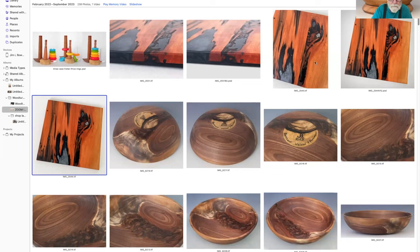Now, I'll admit they were both using Alumilite. But it reacts extremely badly to any moisture at all. When you put it in a pressure pot, it came out as if it had foamed. It created foam bubbles right at the intersection of epoxy and wood. Well, I think you're referring to a polyurethane Alumilite, which would be very moisture sensitive, but most of the deep pour epoxies are not very moisture sensitive and don't usually suffer the same problem.